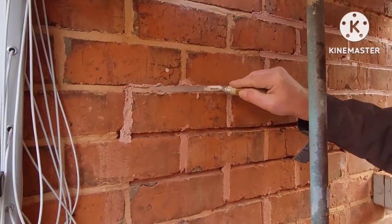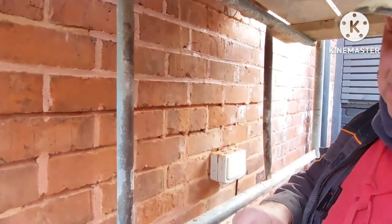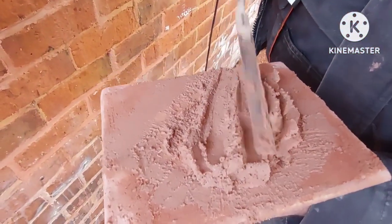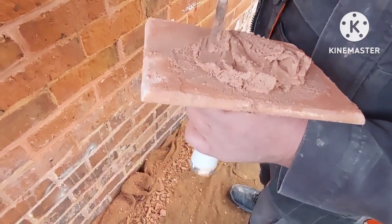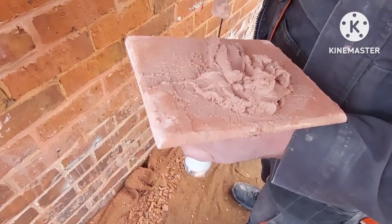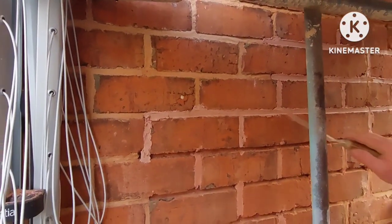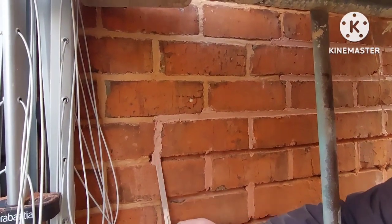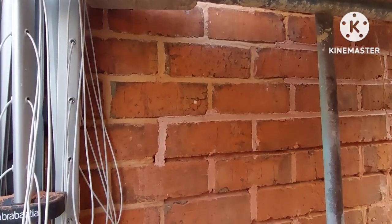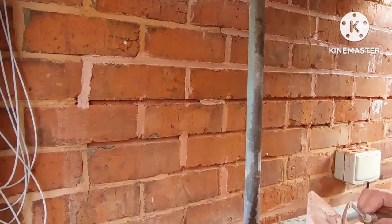The material is lovely and sticky — you get a big dollop on your trowel and it's not wanting to just fall off like it would with a cement mortar. Now this stuff is lovely and flexible. I mixed it yesterday morning — a big batch in the bin. We used it hot yesterday but obviously it cooled down overnight, and we haven't added any water. When we took the lid off the bin this morning it was ready to go, and that's purely because it's quicklime. Now if you're using an NHL, you can't do that — you can't leave it overnight and reuse it, because it starts to crystallize and lose its set. If you were to just wet it up and reuse it, chances are it's going to fail. Whereas quicklime, as long as you keep the air from it, it'll last pretty much indefinitely.